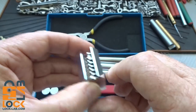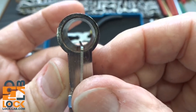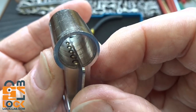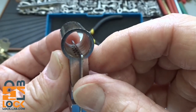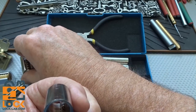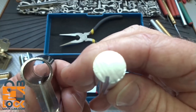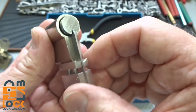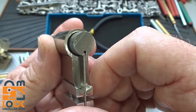Then we can take our core out of the pick block and put it in our little holder to keep from spilling all the pins. That spring tension tool is holding all the drivers in place so we can repin the lock. Slide it back and forth, and when it's fully loaded it's back in position - we've repinned our lock. Then we slide the follower back in there, remove the tool, and slide the core back in. Very cool, very well thought out.